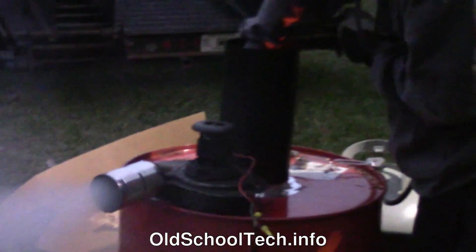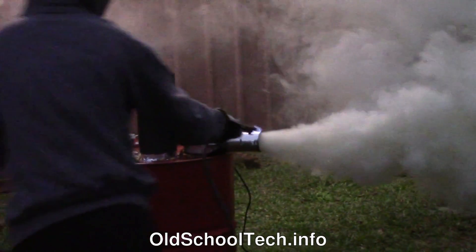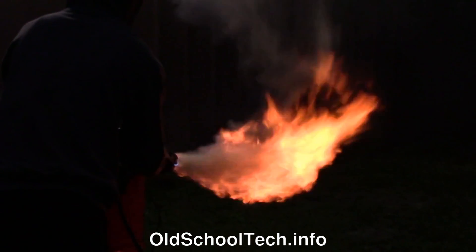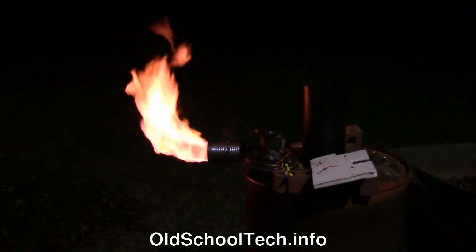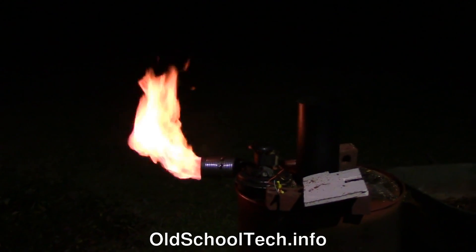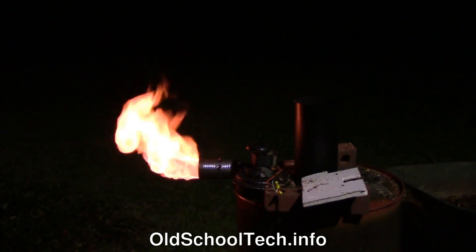Once the flame front starts moving, put more chips in at the top. For your first firing, you will get a lot of smoke, which will easily light with a propane torch. This big flame is from burning off the paint, and in this case about a half a cup of ISO-46 hydraulic fluid that was left in the barrel. After the initial burn off of paint and oil, the pyrolyzer will reach a steady state and should hold the flame. If your flame won't hold, don't worry. We'll show you in the next video how to optimize the gas generation to keep a more or less steady state. The important thing at this point is that you can light the gas at all, even if you have to keep an ignition source in the smoke.